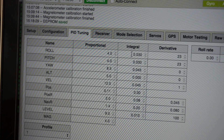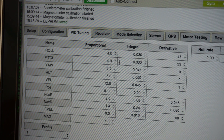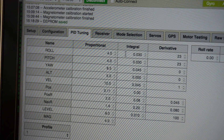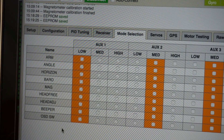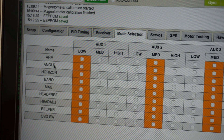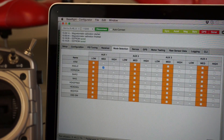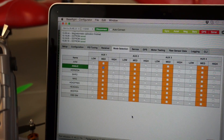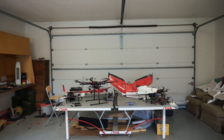Let's go ahead and look at PID tuning. Here are the default PIDs we're going to do a test flight with. These may be a little high just because the mini quad is a smaller profile than what the defaults are probably set up for. We have pitch and roll P at 4 — you can see the integral and derivative values. Before we fly, let's look at our flight modes. You can see a ton of supported flight modes. By default the mini quad will fly in rate mode — sort of an acro with no stabilization. For angle mode I'll set that at medium. With that value set, I'll click save in the bottom right. When I toggle the switch, angle mode goes green, which means it's on — and that's off, which will be our rate mode.